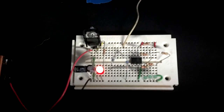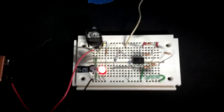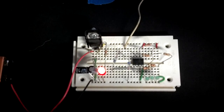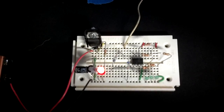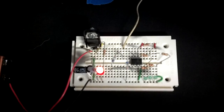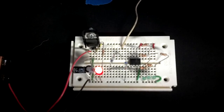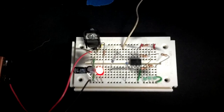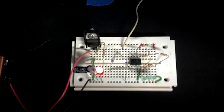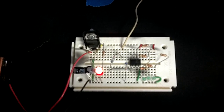I originally was going to do this with a two-line 16 LCD backpack, but again, I figured that was overkill. But it's really easy to do. You can remove the LEDs and simply use the serial out of the PIC to control the LCD bar, and that way you have at least 16 resolution and you can even use the other line for maybe battery level or something of that nature, because I'm not using pin 4 so I have an extra analog to digital converter.